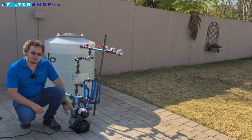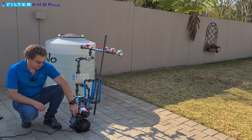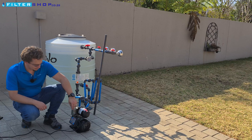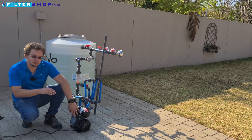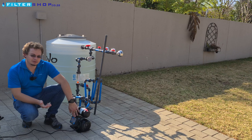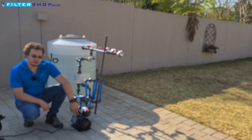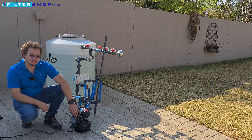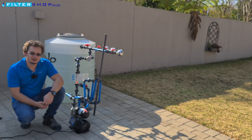Here we have a very popular 750 watt VSD pump with a cast iron head. It comes with a great controller that's used on the nicer HMS stainless steel pumps as well as this one's bigger 1.5 kilowatt sibling. This controller is a variable speed drive so you save a lot of power as it can adjust its speed. It's also got leak detection, dry run protection, and it's one of the easiest controllers to adjust pressure — including the turn-on point for use with a pressurized buffer tank.